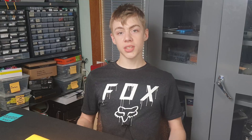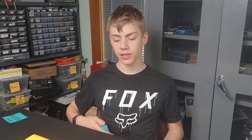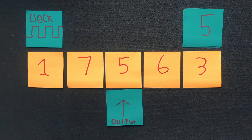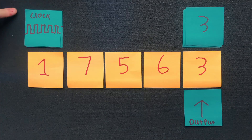I'm going to try to explain how the sequencer works. In its simplest form, a sequencer is just a list of values, and it will send one of those values to its output. Every time it receives a clock signal, it'll change which value that is. A continuous clock signal will make it step through each number one by one. If you want to adjust how fast it changes these numbers, you just have to adjust the speed of the clock signal — a faster clock signal will make it go faster.